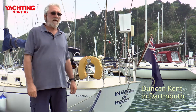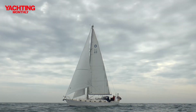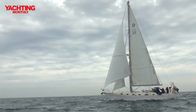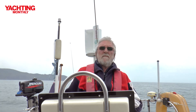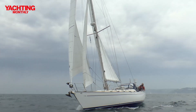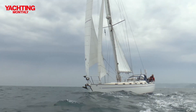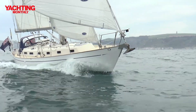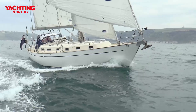We're here today to sail with David Clements on his lovely looking Bowman 40. The Bowman 40 is a Chuck Payne design, built solidly with heavy displacement for crossing oceans and blue water cruising. For this reason she has her weight very centrally placed — the engine is over the keel along with the tanks, and the rig is stout, sturdy, and relatively conservative. She can stand up to a really good blow, but in light air she suffers a little, although this morning in only 11 knots of true wind we had a really good sail and were happily making over six knots, which is pretty impressive for a heavy displacement yacht.